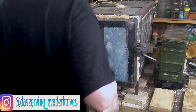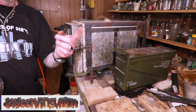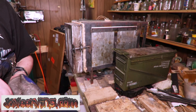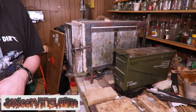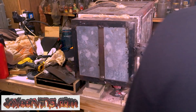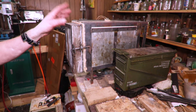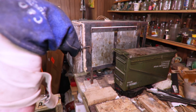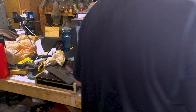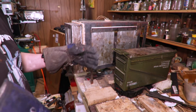I'm glad I checked the info sheet because it says the normalization cycle is one cycle at 1600°F and then let it air cool. 52100 and 80CRV2 are basically the same. So we're going to take it out and let it cool. I've been trying to auto-tune my oven — I actually messed it up a little more, so I've got to auto-tune it again. We're at 1580. Let me get my pull-out tongs. When I open the door it's going to cool down.